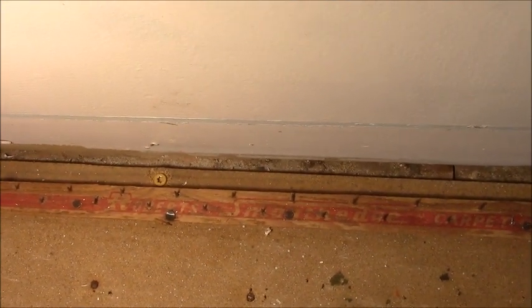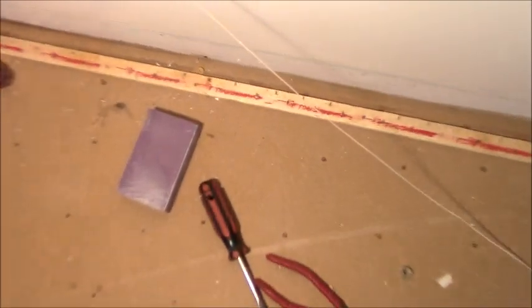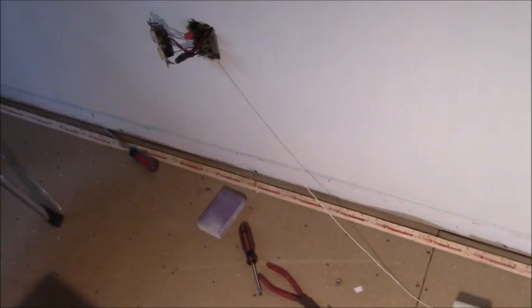right close to the wall. And then I figured I had to go in about another 2 inches. So I did the same over here, and I went down to the basement and I found them, and what I did is I knocked out the knockout in the back of my box, in the bottom you can see it there, and I tied it on a heavy string with a nut. I went downstairs with a coat hanger with a hook bent in it, stuck it up through the drill hole, waggled it around, and hooked my string.